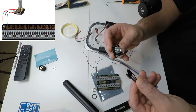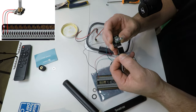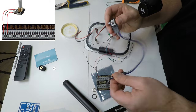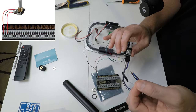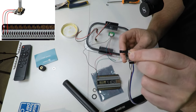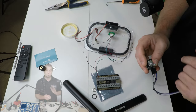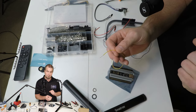The next encoder that we're going to be wiring up today is the Amazon encoder. Now for this, you will need to make up your own wiring harness that will then plug right into the bottom of the switch and now we can wire this up directly to the board. Before I wire this up to the board, I would first like to show you how to use the crimping tool to crimp your terminals on the end here. I'm not going to go through all of them. We're just going to do one so you get the idea. For this, we're going to use the same yellow wire that I had tinned earlier. However, we do not need to tin the wire when we're going to be using the crimping tool.